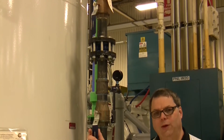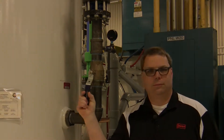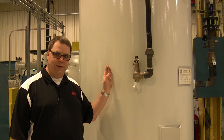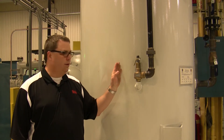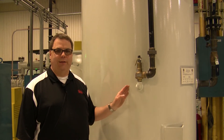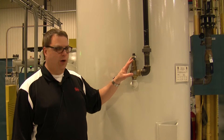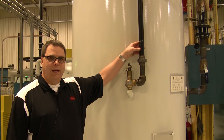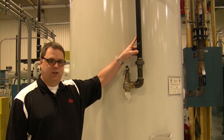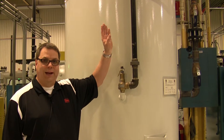The second valve would be utilized for flowing or changing the speed of the gas entering the tank if needed. This device here is a safety relief valve to protect the furnace and the tank from inadvertent over-pressurization. It is pre-factory set to relieve pressure on the tank should the pressure inside become too high. It's good practice to pipe this valve up and out of the facility or into your venting system — as you can see this particular customer has connected it and ran it to the ceiling to take it out of the facility.